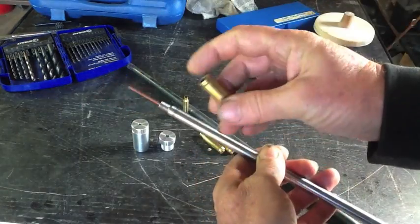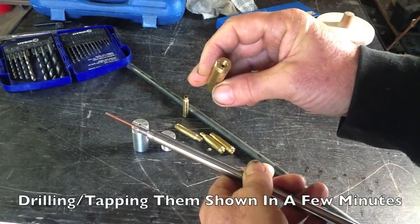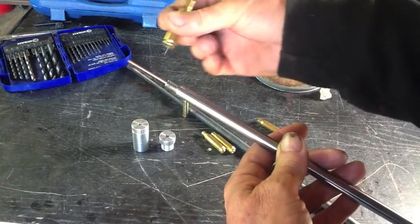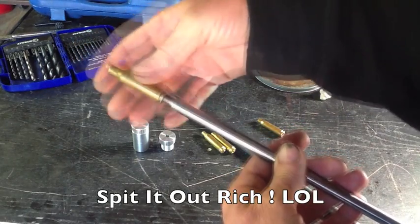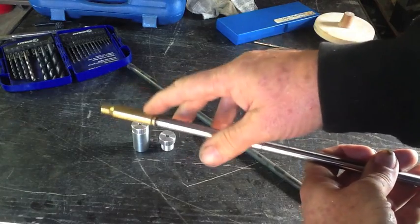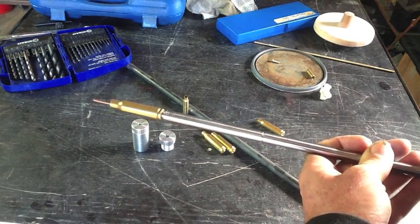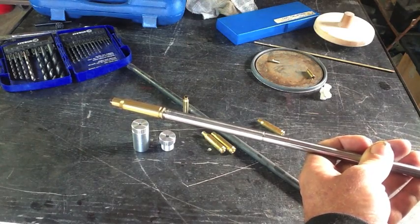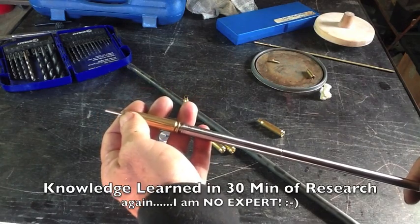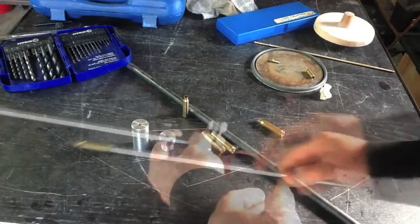The whole concept of this device is you take some bullet casings, drill them out and thread them to fit on the end of the rod — I've already done one as a test casing and it threads on there like that. You insert this into the chamber of the gun and advance the bullet into where it seats on the grooves in the lands. Once you have placed the bullet where it needs to be, you lock down the rod and then measure using a caliper the overall length — how far you need to seat the bullet down into the casing when reloading. It's a little complicated, but I went ahead and made it. Turned out pretty nice.